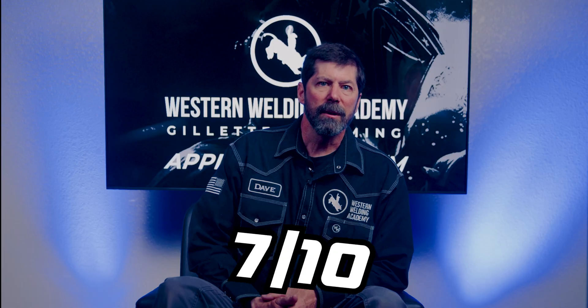So Vinny, props to you for trying a heavier stick — a 5/32 stick. Keep up the good work. Go up with your amperage a little bit. Make sure you're paying attention to the distance of your stick to your material. Looks like you do have some porosity in there. Try to maintain a straighter line — that way you'll get your beads coming out a little bit nicer. Make sure that you are cleaning up your welds. Wire wheel them after you finish them, because we can't quite see what the weld looks like being that it's still covered in slag. I'll give you a 7 out of 10 on this. Keep up the good work.